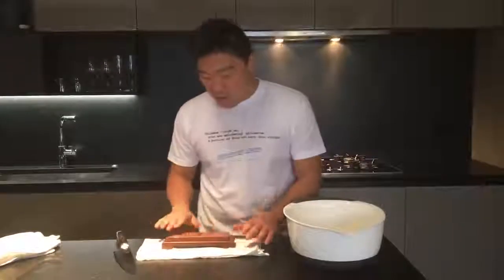There are a few things about them. I generally go for one grit, meaning how smooth or how rough the surface is. This is fairly smooth. I don't need a multitude of stones. I use one that's about this, probably like 800, maybe 1,000, and you just have to work on it.